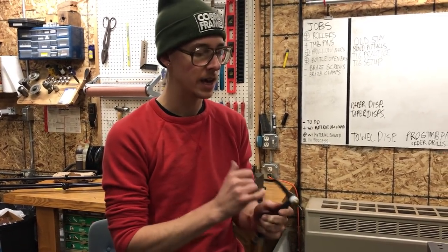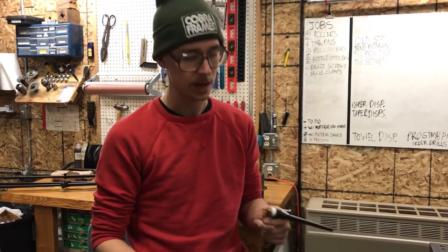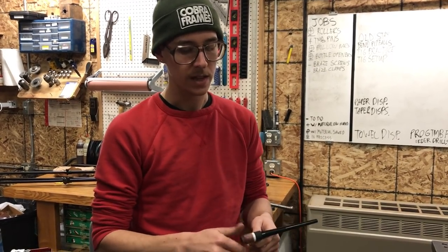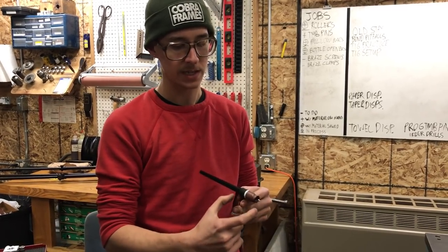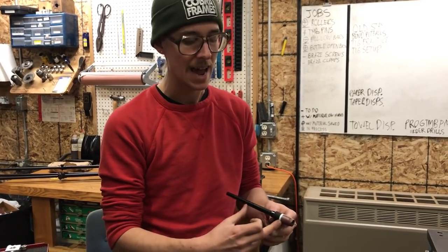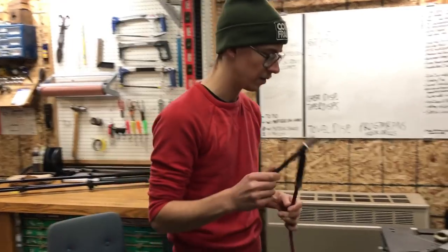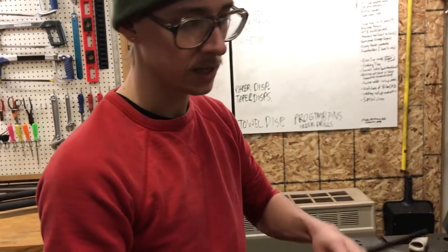I took his advice and I kind of like it — I don't find that it gets in the way. Welding is all about what you're used to, and you can get used to just about anything. Running a full-length back cap also allows you to get a lot more life out of your tungsten. Instead of throwing it away when it gets down to about two inches, you can use the one stick most of the way up — so I like to use a full-length back cap on a torch like this and I have no complaints.